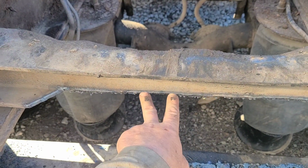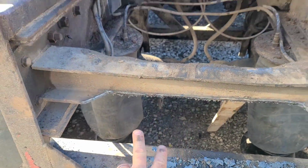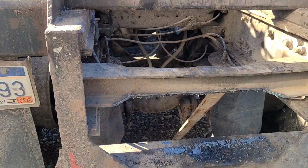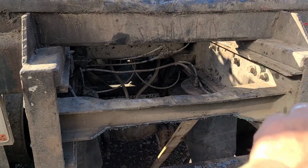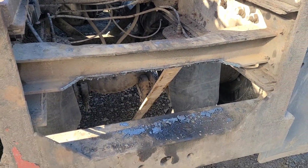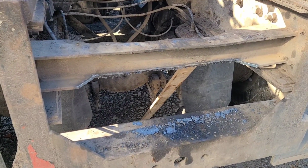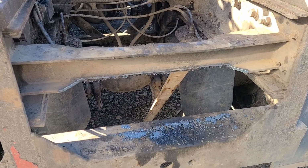One of the problems would be if you hit this lower flange of the beam. Now, I'm making this beam so much stronger by plating across there and tying it into that bunk, that probably the easiest thing to do is just cut that flange right out of there, and you can see where I've already done that.